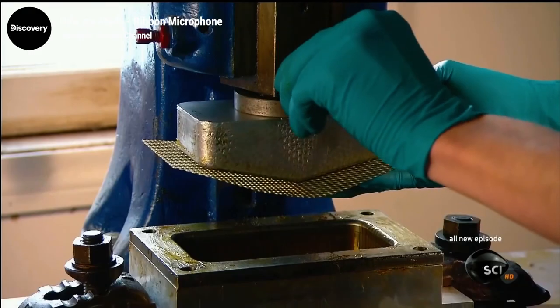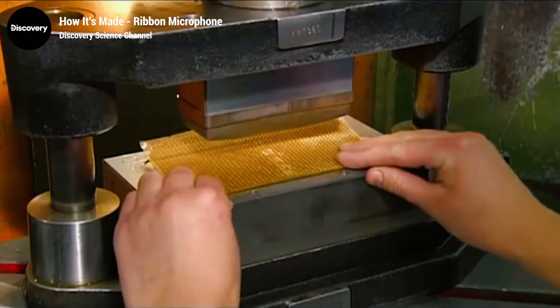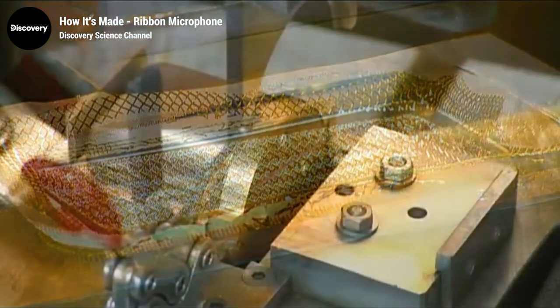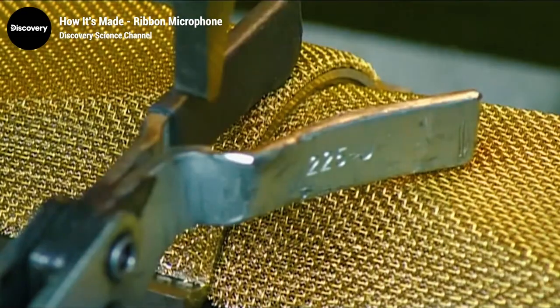The exciting thing about this technique is that you can use heat molding with hot water to create complex mesh structures and even experiment with molding microphone body shapes. This technique opens a lot of possibilities. Imagine replicating some vintage style microphone by printing flat grills, making some sort of clay or wood template to bend around, and you're done. Easy design, easy print, structurally robust and no overhangs to deal with.